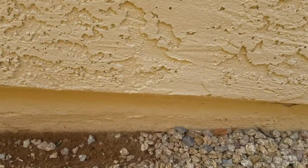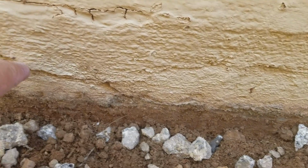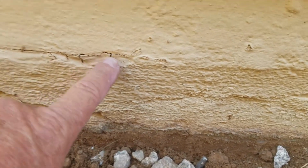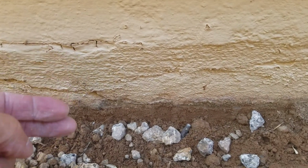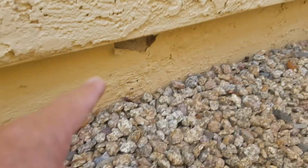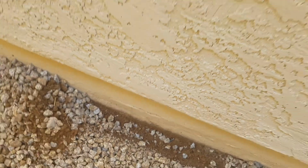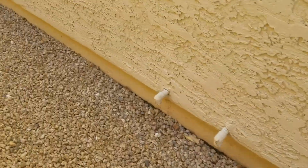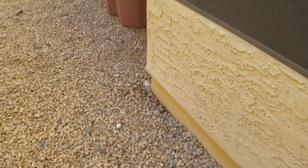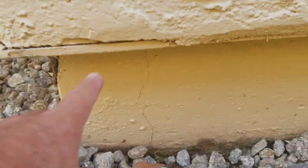Here, this is oxidized rebar in here. There's crack down here and separating up here as well. So this interior steel seems like it's just breaking the side out. So this area, probably to that location right there, very small, short area, needs to be repaired. We cut out the steel, replace it with new steel, encapsulated with epoxy rust inhibitor. I don't think this is going to be an issue here on this corner.